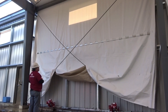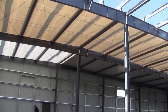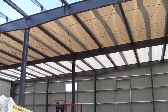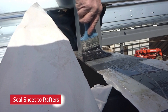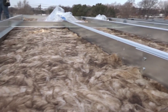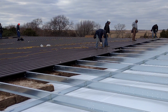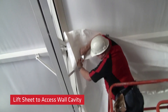The winch operator guides the AutoSeal sheet downward and prepares the sheet to be tensioned. The AutoSeal is Class A fire rated material and has vapor retarder and air barrier qualities. AutoSeal provides the first step for a high-efficiency thermal envelope. Once the system is tensioned, lock the sheet in place with compressor attachments from the top side of the structure, and simply seal along the main frame rafters. With the AutoSeal sheet locked into position, it allows the installer to simply lift the hanging sheet to access the wall cavity and clamp it above.